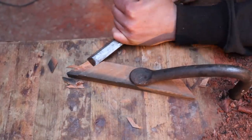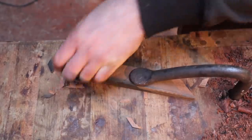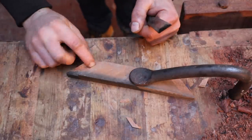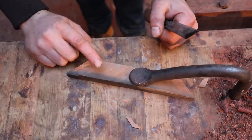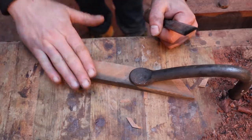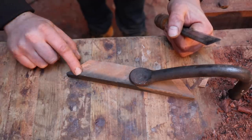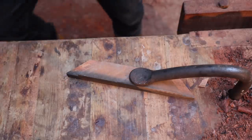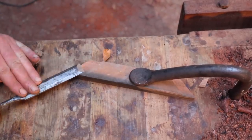The type of brace I'm going to show you is where I have one shoulder on one side, because the other side is mostly hidden. I'm just having the shoulder on the inside so there's no gap visible down the side of the mortise. If both sides are visible, you'd want a shoulder on both sides of the tenon so it hides that mortise underneath it.